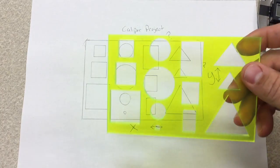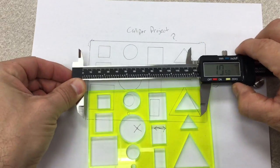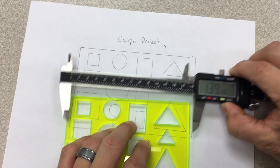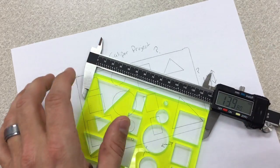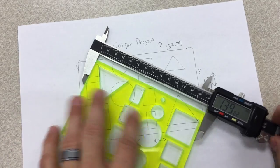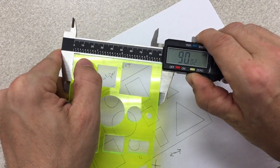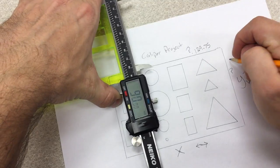With your calipers, make sure they're on and say zero. Pull them out, put them next to your block and measure. It says 139.75 — and a couple of readings confirm that's about right. So I write 139.75 for that line. Then for the other side, I take the jaws and slide them until they stop on this block. It tells me it's pretty much exactly 90 millimeters. So I write 90 millimeters for that line.